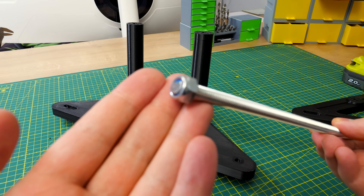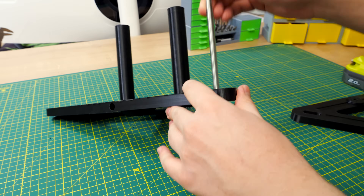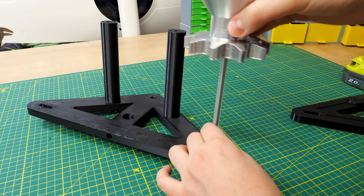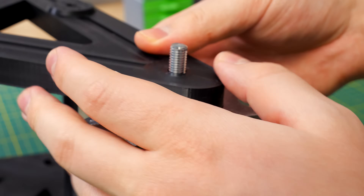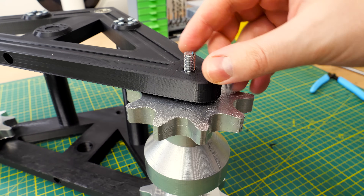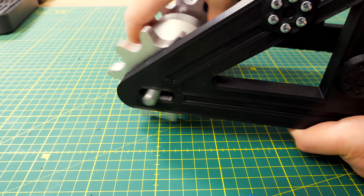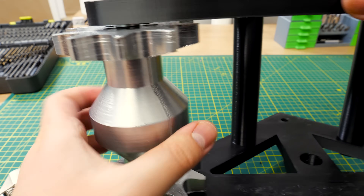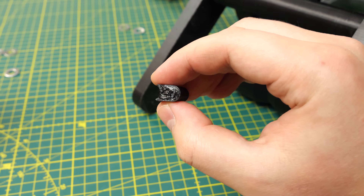Next we need again an 8mm threaded rod with one M8 lock nut already screwed onto one end. Add one washer, push it through the hole, then two washers, the sprocket wheel, two more washers, and then the other 3D printed side. I repeat this for the other sprocket too, then attach the other side. Here I made a little mistake — this sprocket can move back and forward because I wanted the ability to tighten the chain, but it's not going to work. If I tighten it too hard the sprocket won't move freely, but if not, the sprocket sits at the maximum loose position. I fixed this by printing a spacer, hammered it in, and the sprocket can no longer move backwards.